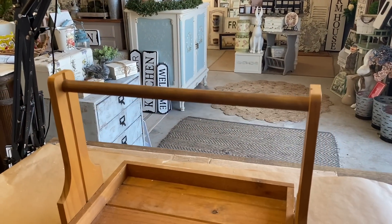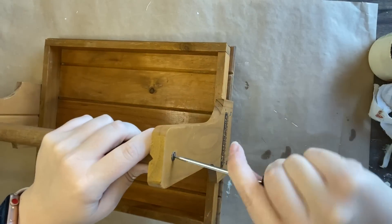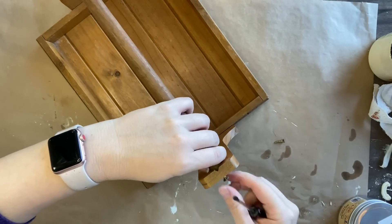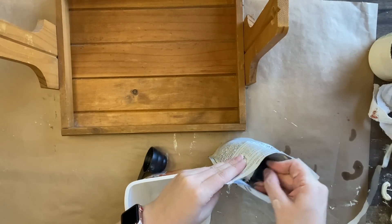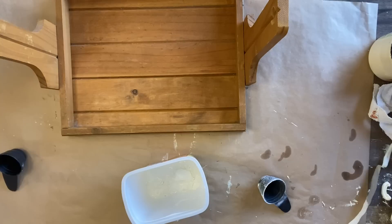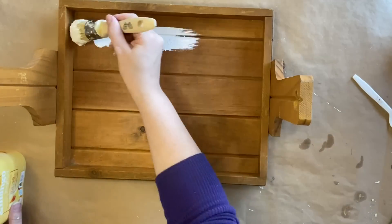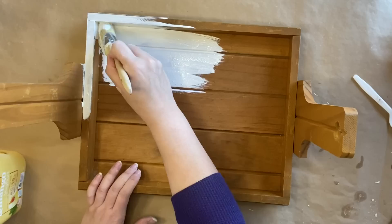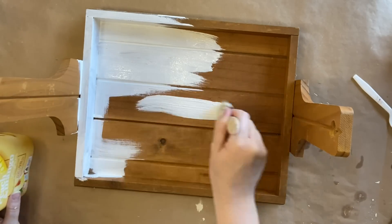Our final project today is this little wooden caddy tray — I found this for a few dollars and I've been wanting to do it up. My first step after cleaning is to remove the little handle; there's a little screw on each side that I'm going to take out. I'm going to be using Hotel Robe by Fusion — this is a milk paint that I have not tried yet. It's a lovely bright white. I'm mixing one cap full of milk paint to one cap full of water and stirring really well. I'm then using a natural bristle brush to apply a thick even coat. I'm coming in pretty thick because I want to achieve that wonderful cracking and chipping that I am obsessed with.